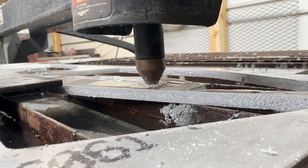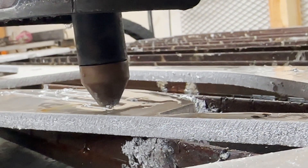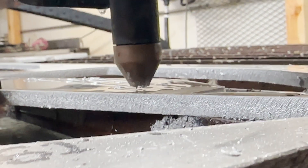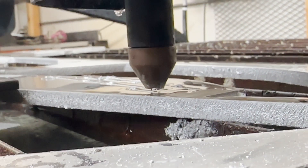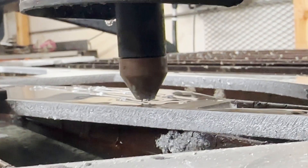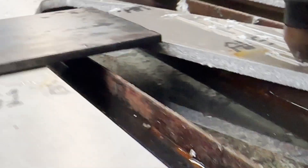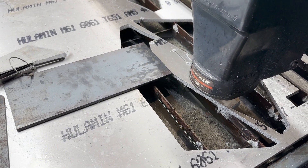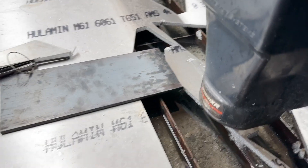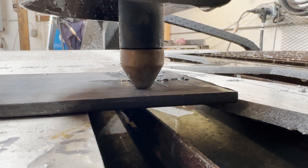Even that is a lot. I get the feeling aluminum is probably not the best substrate to do this calibration on. There's a lot of gunk — given the properties of aluminum — building up on the bottom of this torch, and I feel like this is interrupting its ability to calibrate itself with the torch height controller. So I'm going to switch over to steel and hopefully it'll have a better time dialing it in for me.